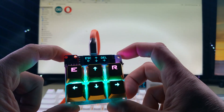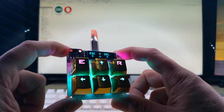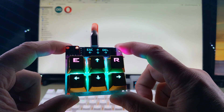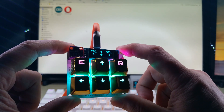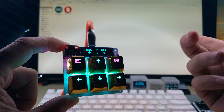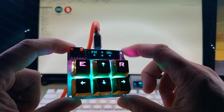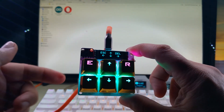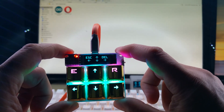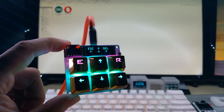You can upload other code to it using the Arduino IDE by selecting the Leonardo board. You just open the IDE, select the code, click upload — it uploads, and as soon as it's finished uploading it turns into a keyboard again. You don't have to unplug it, you don't have to select anything — it's very, very easy. I was surprised myself.